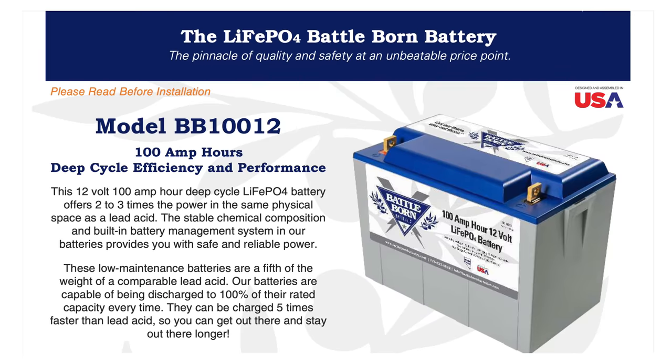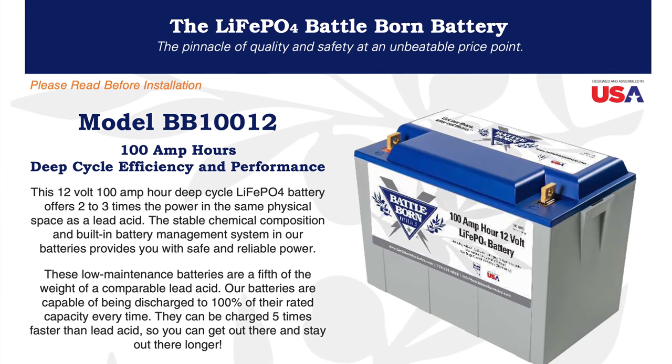When I was sizing our battery bank, I kind of did it based on what I could fit there. Turns out they match up pretty well. We have 10 100 amp hour 12 volt batteries from Battleborn, and that calculates to 12,000 watt hours. Again, I'm not going to go into the math on all that, but 12,000 is bigger than 10,500, so we have enough batteries. And then again, that's just a very rough example. We're going to be running other things, you know, our computers, our TVs, things like that. But 10 batteries was all I could fit up there. Plus, they are super expensive. So again, that factors in as well.